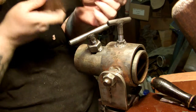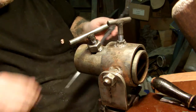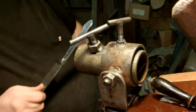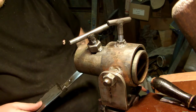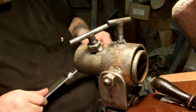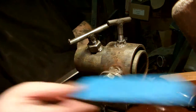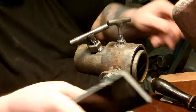It's going to suck a little bit. All right, well, I'm just going to have to add some epoxy filler in there. And when I put this together with the all thread, which will be stainless quarter-inch all thread, there's no way it's ever going to slip or come off or anything like that once it's epoxied together. So, that's about that.